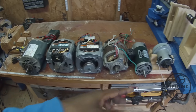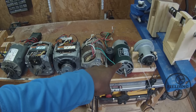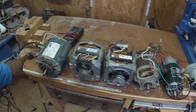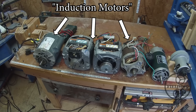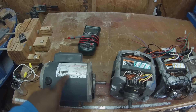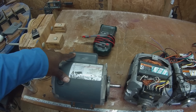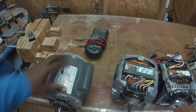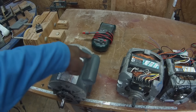There are many different types here. That one's brushed AC, this one is a DC motor, that's an AC, and the rest are all AC, single phase, and they are brushless. What's important about single-phase motors is they have a start capacitor. You can usually tell it's brushless and single phase because it'll have this big bulge on the side, which has a capacitor inside.